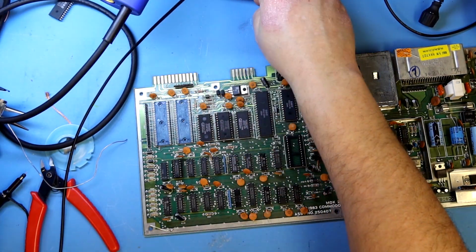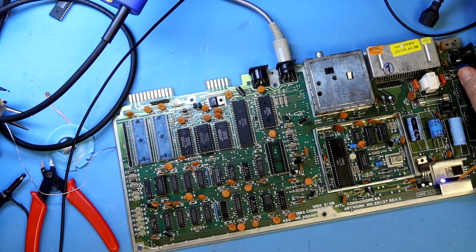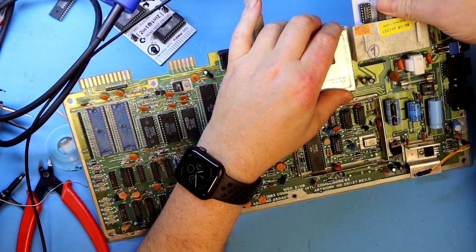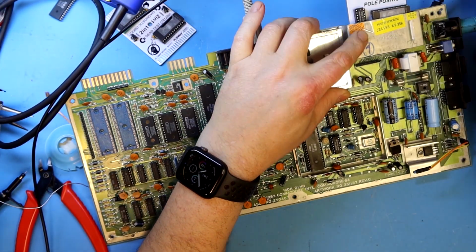Then I do a quick test, just connecting the monitor, not the sampling device, and just see if there is any improvement. I do doubt it, since we also have the trouble with the address lines, and as I suspected, the black screen is still there, but at least from our test we know that the memory chip was also bad, and that fault is at least fixed.